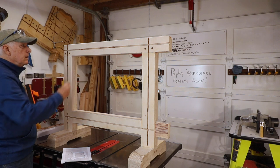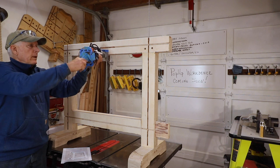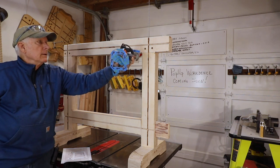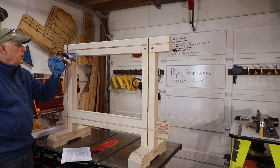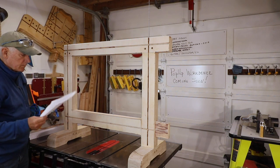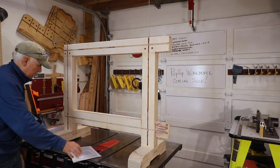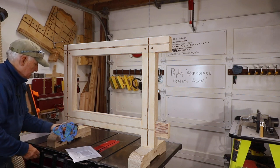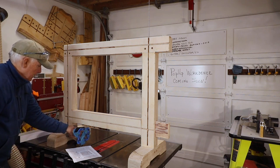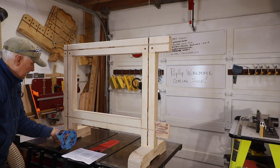Here's my spin and I'm dropping the router bit down on there — that's number two. Number three is up here; I'm doing the bottom of this top rail. Here's a picture of the way the router blade is spinning. Do I go A right to left, or do I go B left to right? Put that down on your paper. Number four is down here on this leg. The router is spinning this direction — do I go A right to left over the edge of that leg, or do I go B left to right?